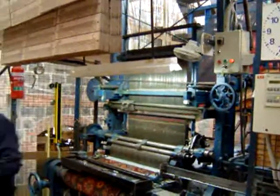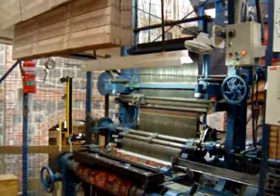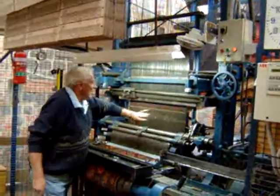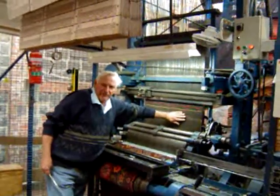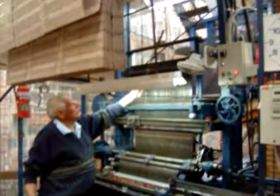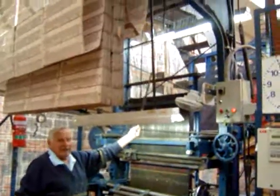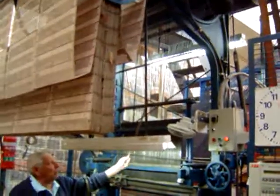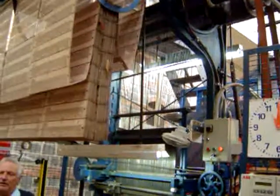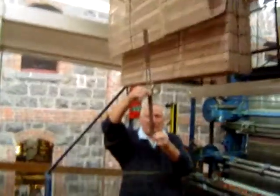Now, how do we do it? What's Jacquard's amazing idea all about? Well, we shall find out. Now, that's called a yarn carrier simply because it carries our yarn. Connected to the yarn carriers are all these wires. Every carrier has his own wire. They all operate independently of each other. But most importantly, the other end of the wire is connected to one of these.